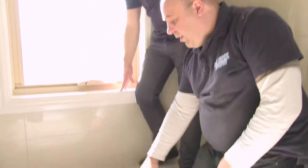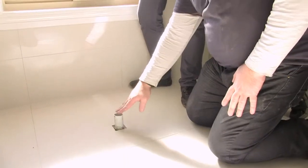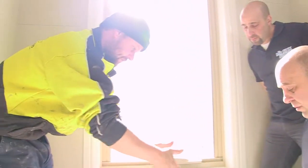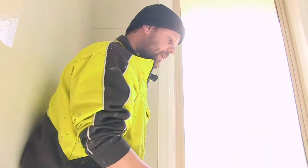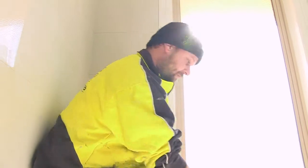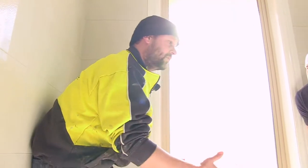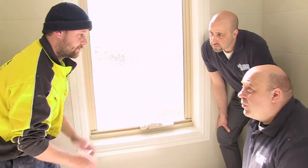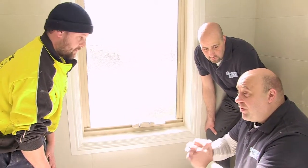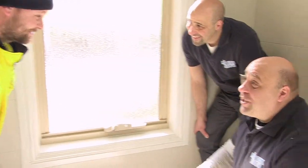Aaron, can you explain how you've done the plumbing here? Prior to tiling, when they do the slab they leave a point for us — it's all boxed out. We come in once we've located the side of the bath, set it up in the center of the room, cast it into the concrete, and hold the trap in position. The waste is in the center of this particular bath, which is why it's centered in the room — but not always on every bath. That's why it's important to know where the waste is before you do your plumbing.